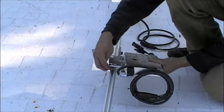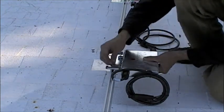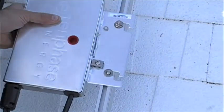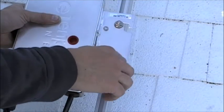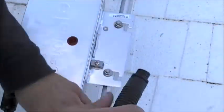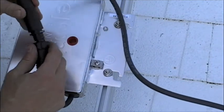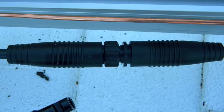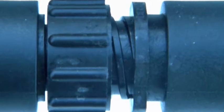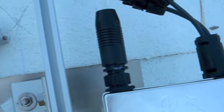As we secure each micro-inverter for each panel, we do our best to space them evenly between each side of the panel. Keep in mind, the cord to get you to the next micro-inverter is only 5 feet long, so you may need to think about placement order when daisy chaining them together. This particular M190 inverter can only handle 15 micro-inverters on one branch. Since this installation has 25 panels, we're going to have 15 on one branch and 10 on the other. You twist the wiring harness until you meet resistance and it clicks, but don't be surprised when you still see threads showing. It's also extremely important to put the end cap on the last micro-inverter to protect it from moisture or debris.